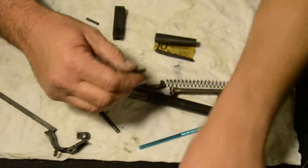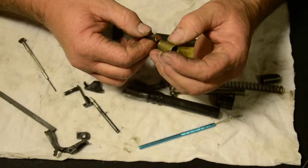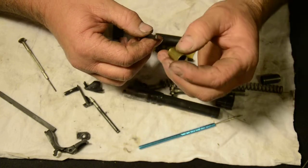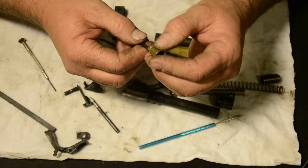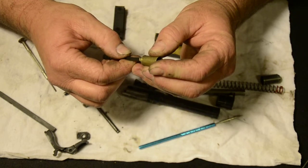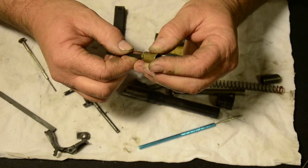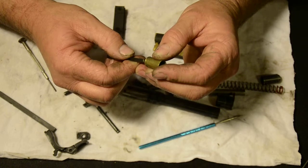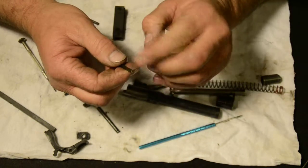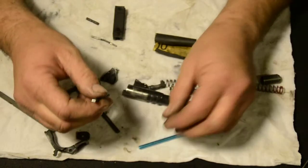And what happens is, sometimes when a 1911 chambers, sometimes they will recoil, and the round will come forward out of the magazine and start in the chamber, and then the slide comes up behind it, and your extractor hits the rear of the brass like this. Well, you want that angle and you want that polish so that it'll snap around and go on home. Okay? If it's flat on the end, it'll stop. It'll cause you to stop it. So you want that slightly angled and polished and rounded. And that is it for the extractor.